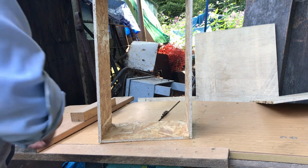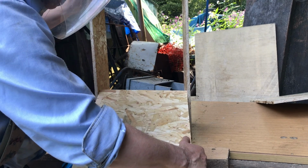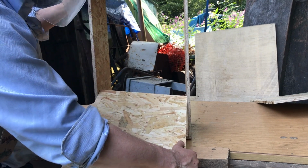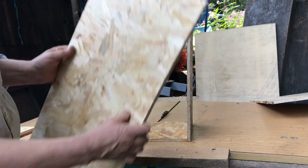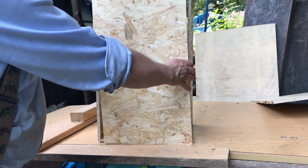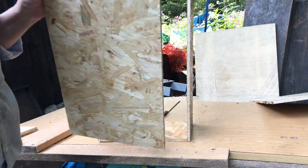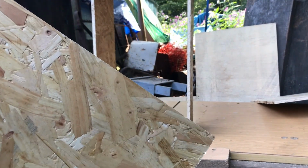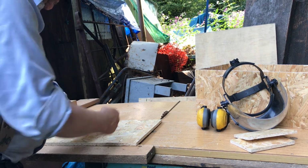So if we now look at a box which is being pulled a bit out of the square, it's only got a small number of staples in. You see that's a complete perfect fit inside there without any measurement. So I'll run another one of these off, and then I'm probably going to put the board on the inside, so I need to reduce the width by 2 thicknesses as well. So I've marked things by the same procedure, and now I've just got these ends to trim.